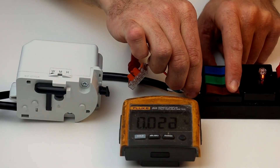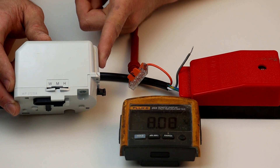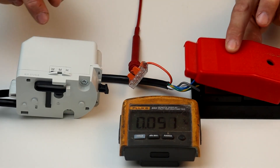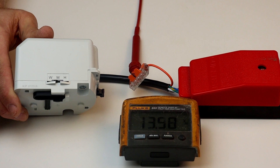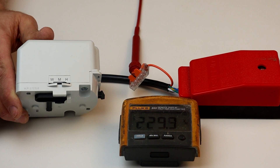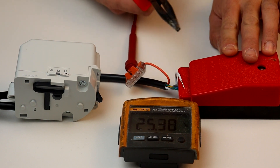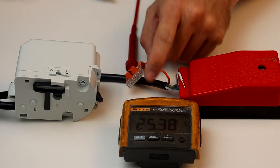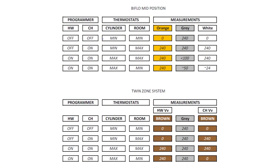The MA1 is slightly different as it's not volt free, as there is no access to the switch common. Neutral and earth are connected as normal. If you energise only the white wire, the valve will move to the mid-position and the orange wire will remain dead. When energising both the white and grey together, the white wire causes the actuator to move to the mid-position, but because the grey wire is also live, the actuator will continue to travel over to the H position for central heating — the orange wire at this point will become live. With the actuator in the H position, if the white wire goes dead, the valve stays in the H position but the orange wire will also go dead. De-energising the valve will cause the spring to return to the W position. This table is really useful when fault finding to understand the expected voltages on each wire under different conditions.